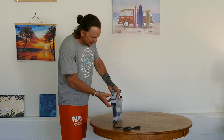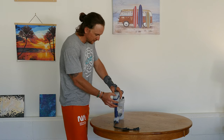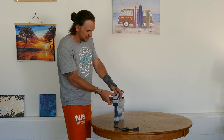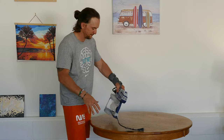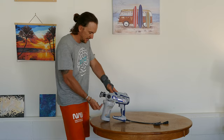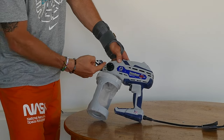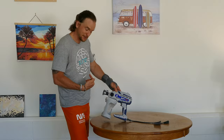Is it necessary? Probably not at the end of the day. But you've got your variable speed, and that's really just your pressure — turning the pressure all the way up, all the way down. Typically on any project, you're going to start with it down and just go up high enough until you get a nice, even fan. Then we've got our priming valve here. That just primes the piston, gets any air out of the system, and gets paint flowing through. Then when you're ready to spray, just point it forward.